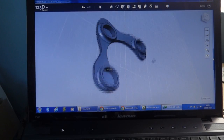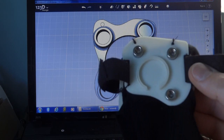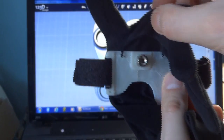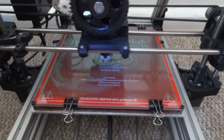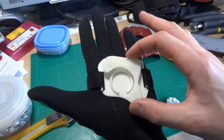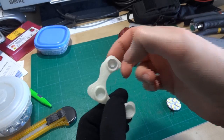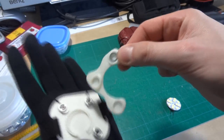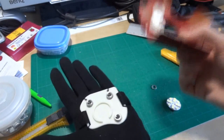Here's an interesting piece I've just designed in Autodesk 123D, which is free software — that is the coupler to go inside the palm plate, which couples to this piece. Obviously it's the other way around, so that plugs onto there that way, and those three magnets match up. So let's get that printed and stick it onto the palm plate. Here's the piece of plastic I've just printed, and that should fit and couple perfectly onto there — which it does. The basic plan is to stick these washers inside, which fit perfectly in there, so that obviously sticks to the magnets because it's metal. And then this piece goes in here so that that can lock on.